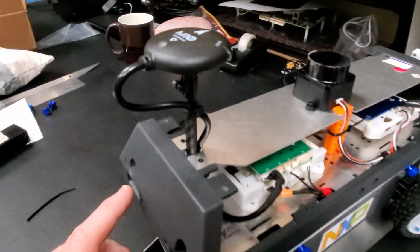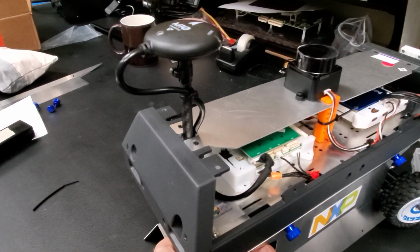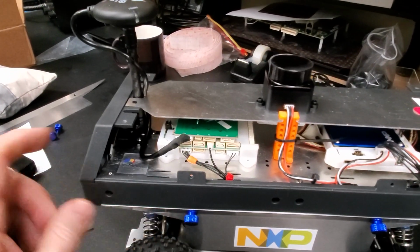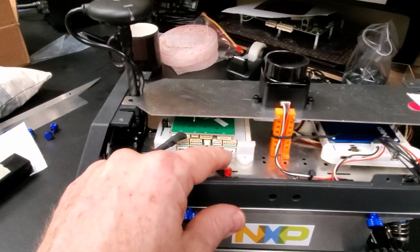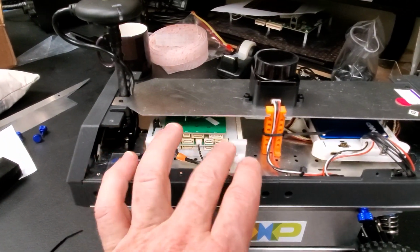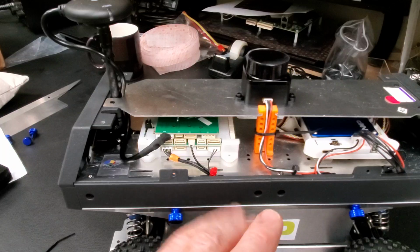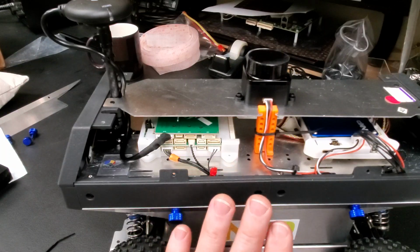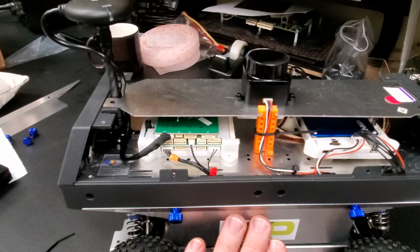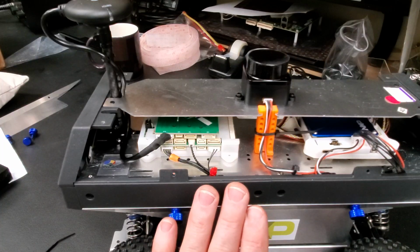So the LEDs that are here, and in the front. 2 of the wires go to this particular connector, which is SPI out, so it's a clock and a data line. And the other ones go down to the PDB board that's underneath here just to give power and ground. Again, that's on the first generation of the PDB and the first pre-production prototypes of this board.